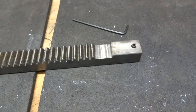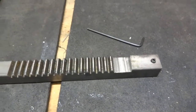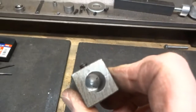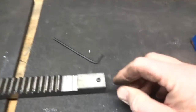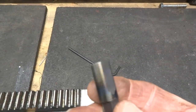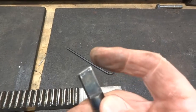In order to make this work, I did cut off a couple of teeth here and created a little flat area — I did this so long ago I don't remember why. We drilled a half-inch hole in the end here and another small hole that we tapped for a set screw, which holds this tool in. This is made out of half-inch water hardening drill rod, and we did some machining to it to make a little cutting edge right here.